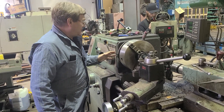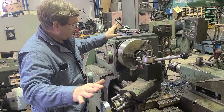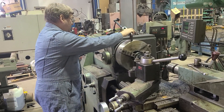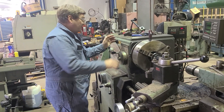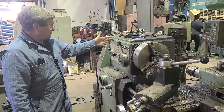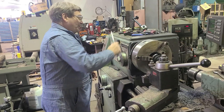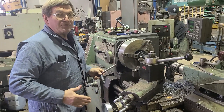When you're first starting out, put your part in the lathe, take your chuck key out, turn everything off, be sure that it's off, put this in neutral. Even with the clutch running, you may want to move the carriage to a different location. Slide it into a neutral gear. Some machines have a neutral spot between two gears that's not marked — they figured you're smart enough to know. Even with the motor running, this is pretty safe, but if you are new to the machine, clutch out if it has one, motor off, everything to where it doesn't rotate.